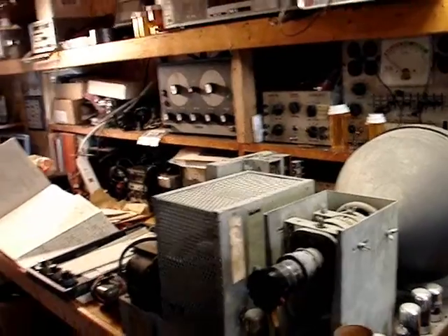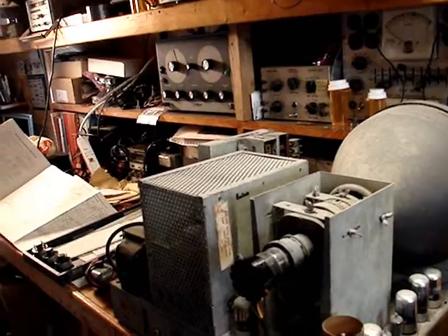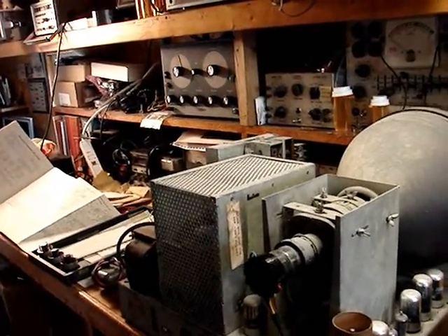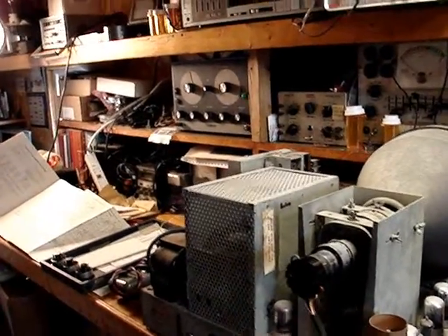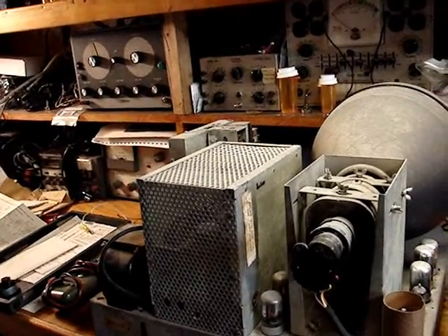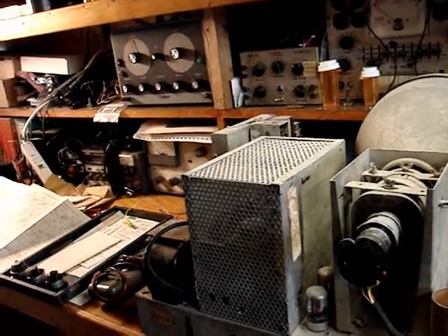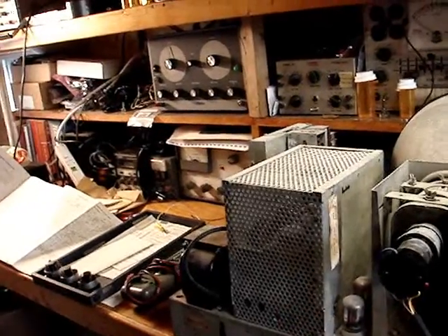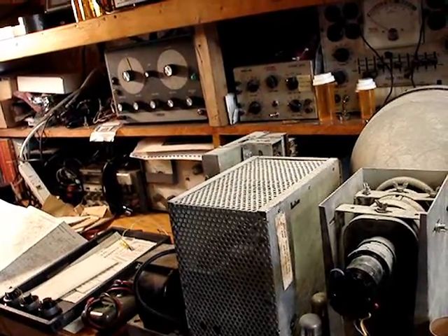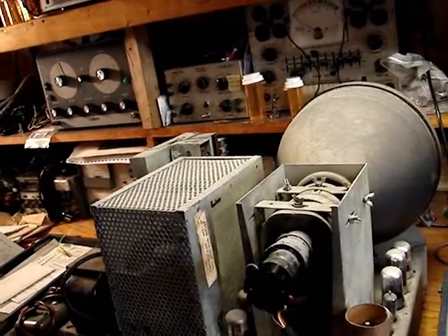So I'm going to take this heavy thing and put it back in the cabinet, and then go on to something else. I had hoped to be able to show the person who gave this to me the restoration progress, but until I locate the right part, I think I'm going to want to find another transformer for it — one that actually has a 5-volt supply for the rectifier and at least enough 6.3 volts to run all of these tubes.